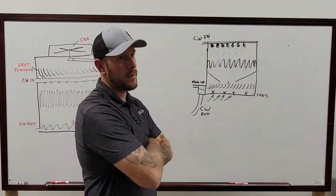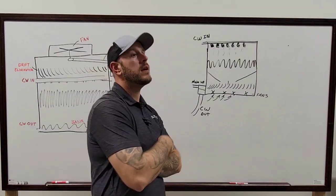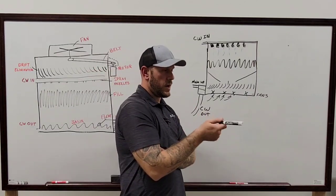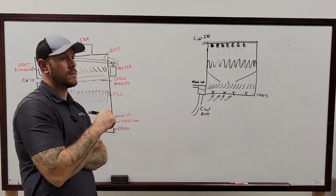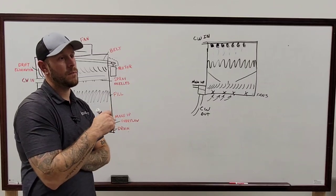If you have a bad bearing or an alignment issue or a messed up belt... Exactly. So it's kind of like a process of elimination, right? It is a process of elimination. Once you remove the motor, you determine the motor is fine, but you've got bad readings all around with the load, then you know it's the load.